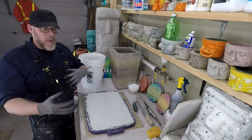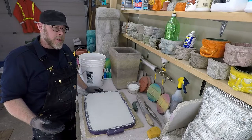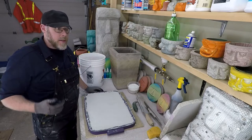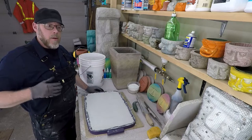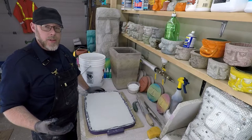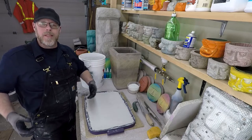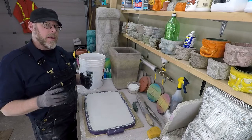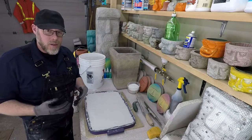And then it's going to turn into this festering, organic, decomposing material that will change in size, change in chemical consistency. It can cause all sorts of problems and ultimately will lead to a situation where your substrate, the stuff under the concrete, isn't doing its job. It's not supporting the concrete the way that it's supposed to, because now you've got this little gap that was about the size of the grass that you used to have.